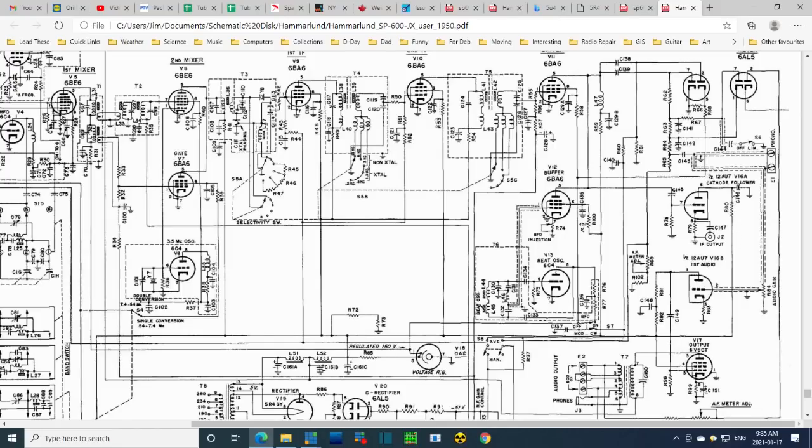And so to make this resistor connection to this wire, this resistor would have to go to another terminal, like a spare terminal or terminal strip or something. Nothing going there. Yeah, we'd have to leave it as a mystery, open mystery. Somewhat not so critical, because it's driving a feature in the radio I'm not currently making any use of. That's it. I've been through all these now.